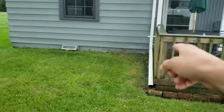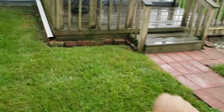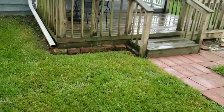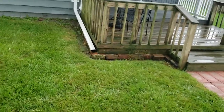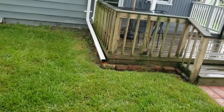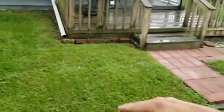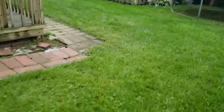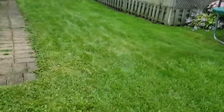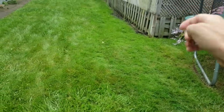The drainage is going to start here, and then there's going to be a patio that comes out 6 feet from here. So come out more than 6 feet, and go ahead and use the trencher. You're going to want to come out past the patio, otherwise you've got to fill the drain hole with limestone. It's just going to be easier to come around the patio.